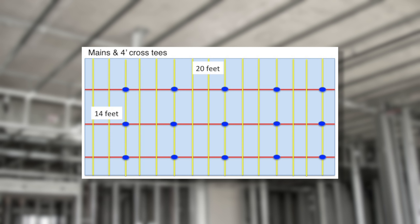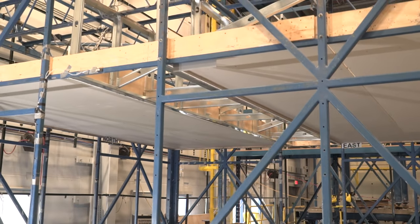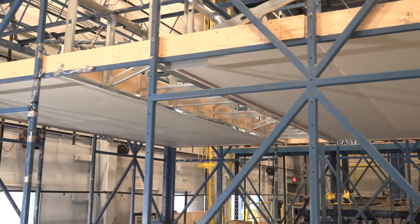In this example of a 14 by 20 foot room with mains four feet on center, you will install 15 wires to structure. With Short Span Peak Form you will only need five wires, plus you can space your T's 24 inches on center, even in seismic D, E, and F areas. Short Span Peak Form is fully tested to perform at 8 foot 6, even in seismic D, E, and F areas.